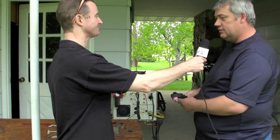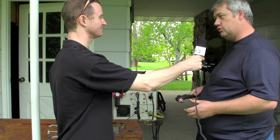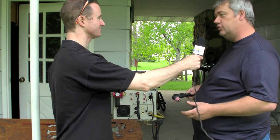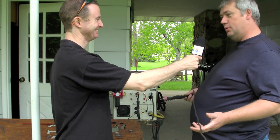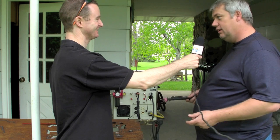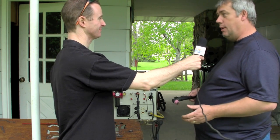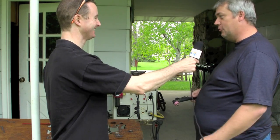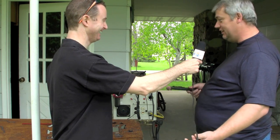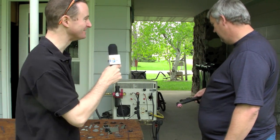There were some circuit breakers popping during the build — trial and error. The plans from the internet were more crude, and through trial and error he learned additional functionality was needed. One example: the unit must be pre-charged. If you go straight to direct power without pre-charging, you will pop a 60-amp breaker. Those big capacitors need to be loaded up first through a resistor off the 110-volt side — priming the pump.